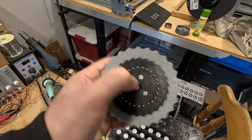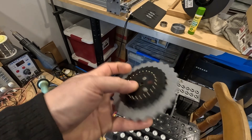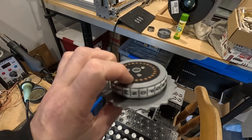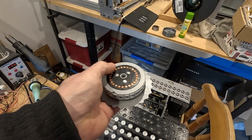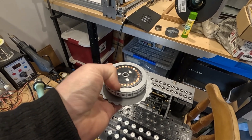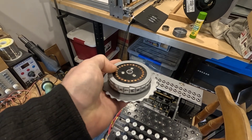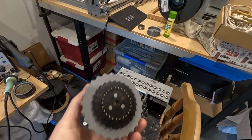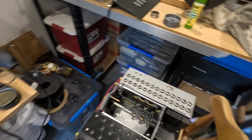You can see there as well the pins are already getting stuck, they're starting to break — there's just so much force on them. I think part of the problem is my contacts here aren't smooth enough. What I would do to fix that is basically replace that with a printed circuit board, so then it'll be nice and flat and smooth. That would be easy enough, but I think the problem is still going to be the pins; there's just too much friction in the mechanism.